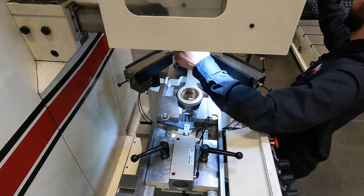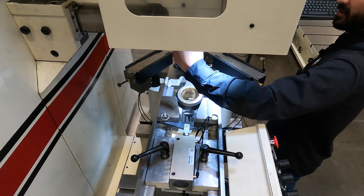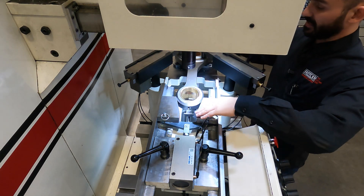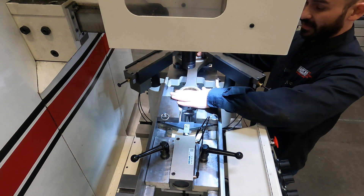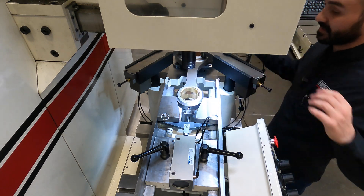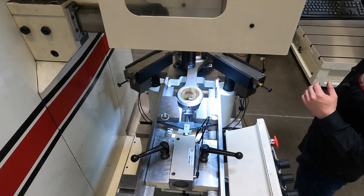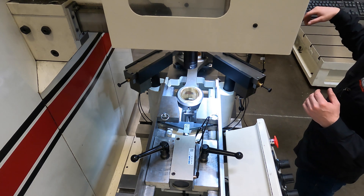To give you the idea, I'll put my boring bar in now. In this scenario, let's say we've just put a new bushing in. The remanufacturing option here is to pick this up and then go set the diameter and the centerline distance in the pin-end bushing. All I've got to do is come over here in the software to probe data on the left.